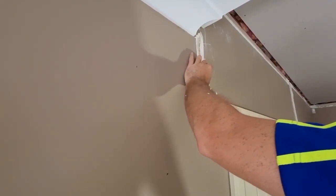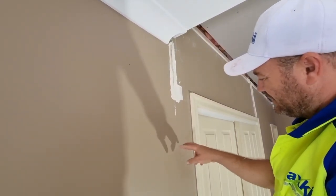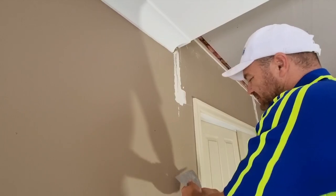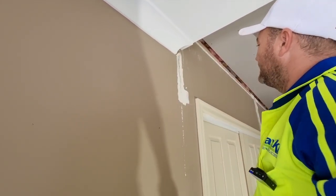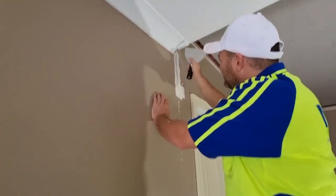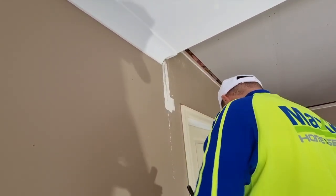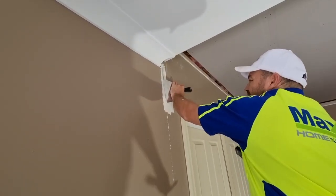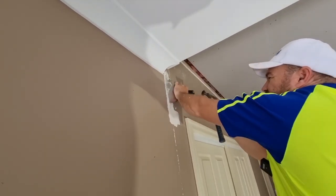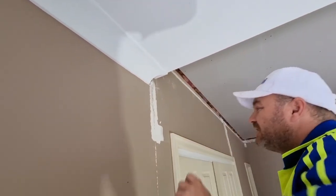What we're going to do to improve it and improve the chances is we're going to try and get some screws in — hopefully there are some fixing points. Then we're going to use our corner cement, which I love — it's the strongest compound in the game. If you're doing a repair like this, don't use mesh tape. What we'll do is dig back so our tape can sit below the surface.